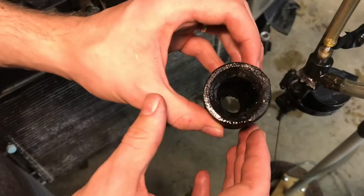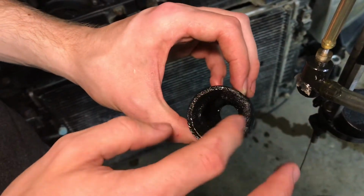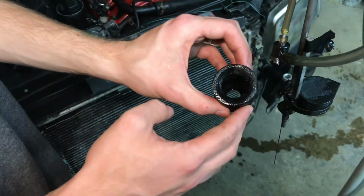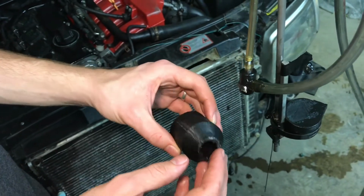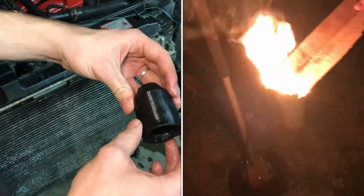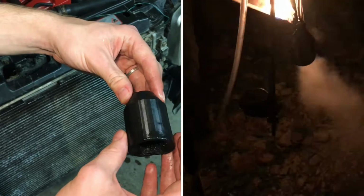1 inch also does seem like a pretty large nozzle, probably too large. That'll probably get a little smaller, maybe 3/4. We've tried half and we're not quite sure what the best size is, but maybe smaller and then also possibly longer, maybe to give the gases a little more time inside the chamber. That'll probably happen in our next revision.